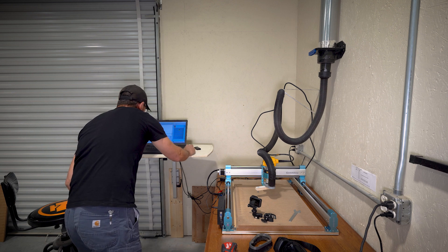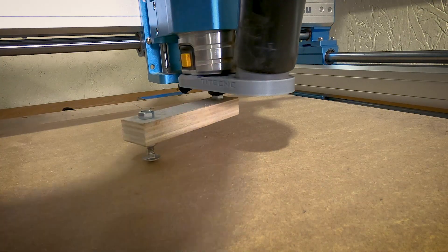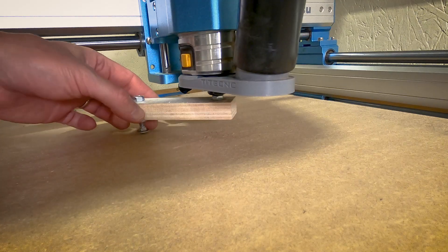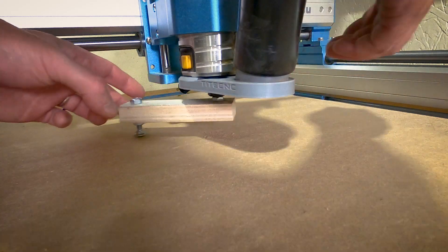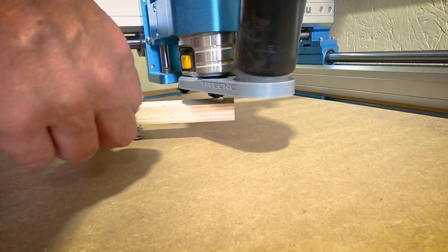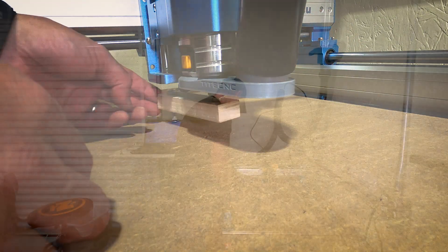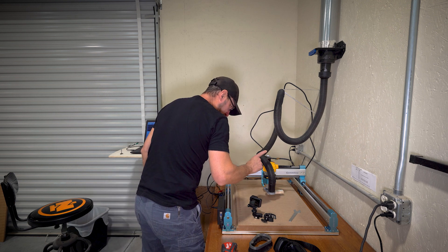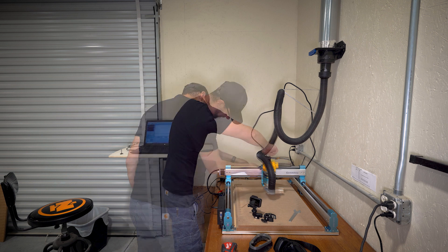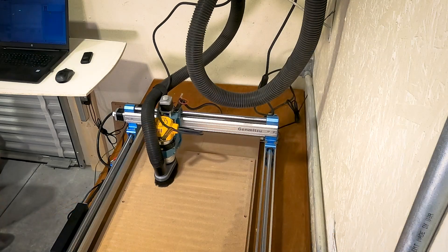I did unplug the router just for safety's sake. I'll get it down the rest of the way with the hand crank on top. It's touching on this side, touching there, not touching in the back, not touching on that side — so it needs to go that way ever so slightly. I made some adjustments to the router mount until the tramming tool was touching all the way around, and then I ran the flattening pattern one more time to make sure it was flat.